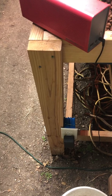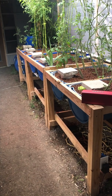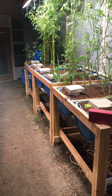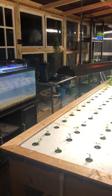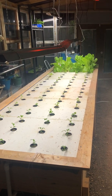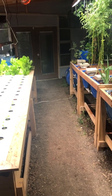I also got 250 feet of Romex wire. I used 14/2 instead of 12/2 — the 14/2 is white and the 12/2 is heavier duty and yellow. I actually have quite a bit left over, probably enough to finish out the fish aquarium and the heater. So two hundred dollars in extension cords versus sixty-two for the Romex setup.